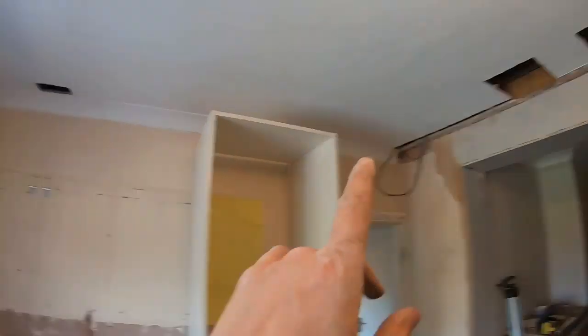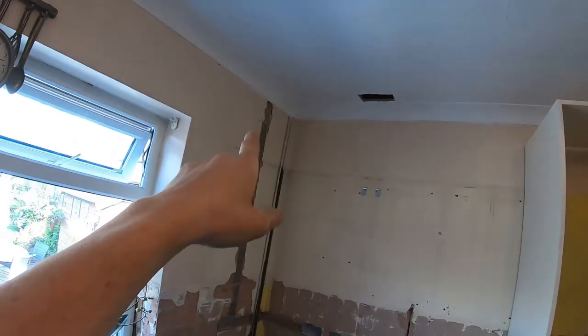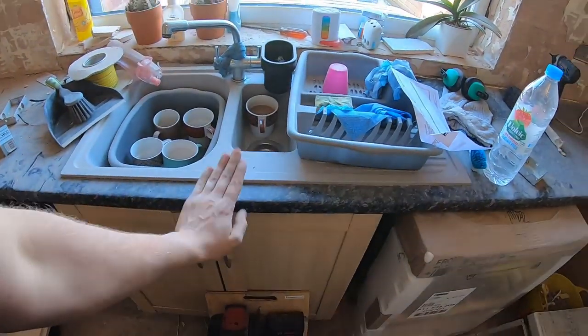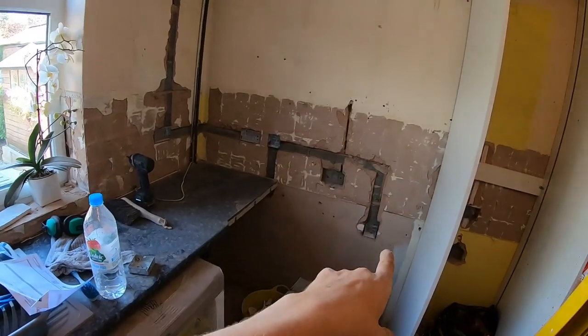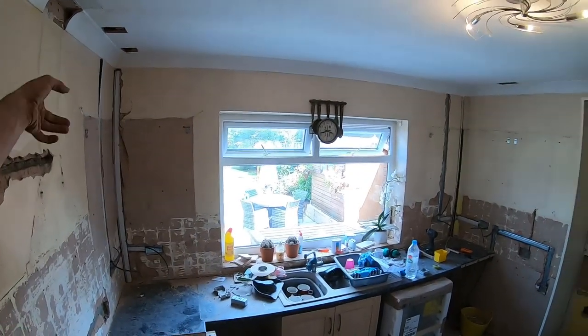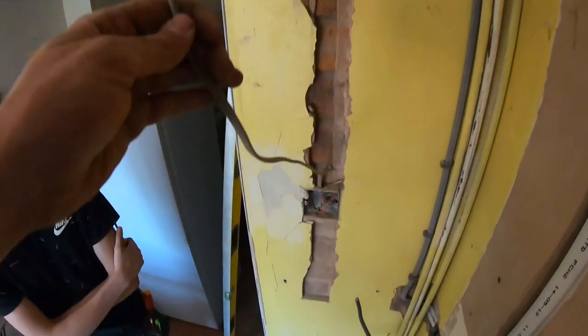We're just going to go and get a rod now from this hole across to do the other leg of the radial across, down to this one, down to that one, through to this one, down for the under cupboard, for sink socket even, and then across for the fridge. Right, cap is all done, like I said earlier, we need to run the under cupboard lights, just sort of chasing this out, figuring out what's what.